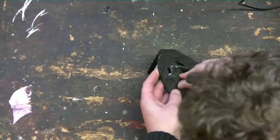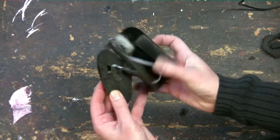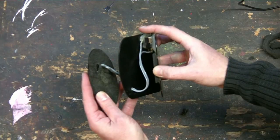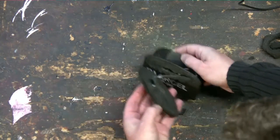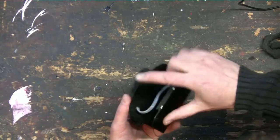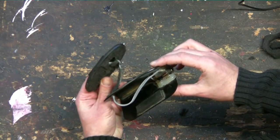Now if you have seen parts 2 and 4 of this series, there are no surprises. You can clearly see the piezo attached underneath the plate. You can see that the cable is attached to the piezo on one side and to the connector on the other side. Because the design is practically the same as the drum pad, I don't think I need to go into details on what parts and tools you need. Aside from the obvious difference in material and size, there is also a difference in the order of assembly. I prefer to have the cable go through a hole in the bottom part, which means I need to put the cable through before I solder the trigger.